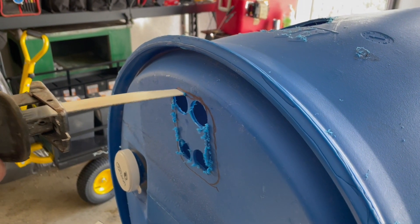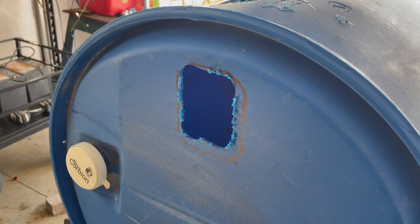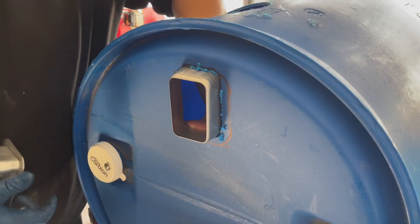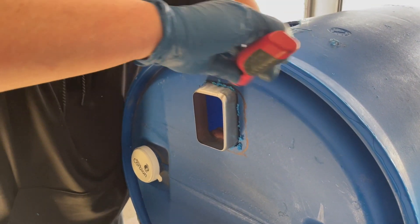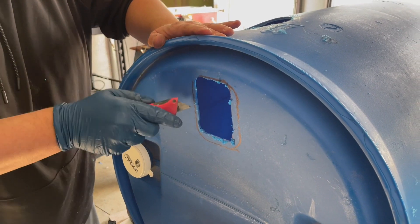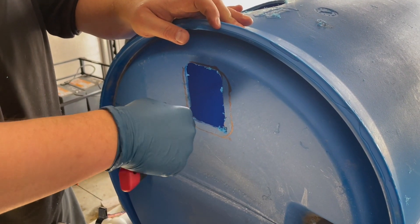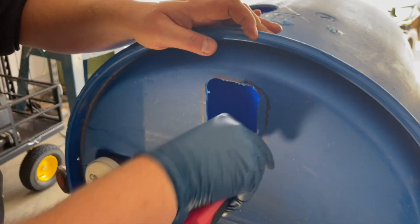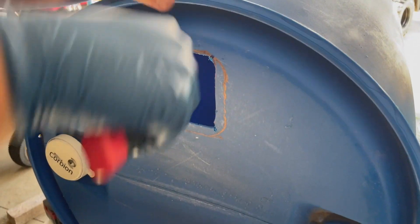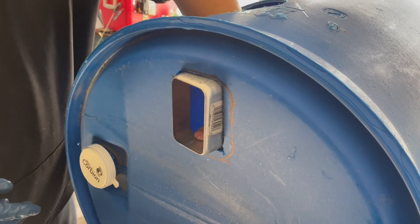When the barrel gets full, right at the bottom of this square hole, any extra water is just going to flow out of the top of the barrel and continue out the gutter fitting I'm going to put in it — like the barrel was never there. Below that line in this 55-gallon barrel, I've figured I'm carrying about 40 gallons, which is great. The rest is going to run off and out that gutter, hooked up to a black downspout extender pipe pushed away from the foundation of my porch. Now I'm just cleaning up the edges of my cut with a razor blade — deburring it — clean up all the holes you're putting in this barrel.